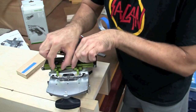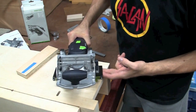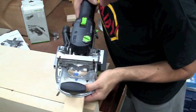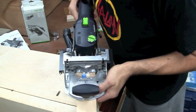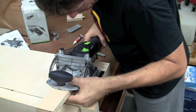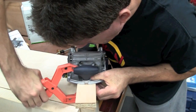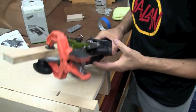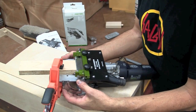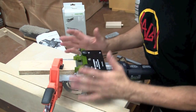With the cursors loosened so I can slide them, I flip the domino over and place the block up against the fence of the body, sighting with the cursor to make sure that center line is right down the middle of the cursor hairs. It's actually pretty good right there. I'm going to get that dead perfect, then clamp the piece of wafer board in place so it won't move. Now that the center point of the wafer board is exactly on that crosshair, I should be able to just slide the guides in until they butt the side of the board and tighten everything up.